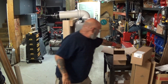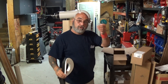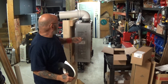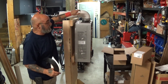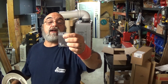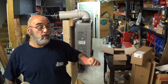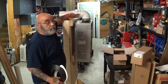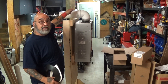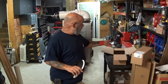You're going to get two thimbles and a bag of screws — three screws per bag. Put your three screws in here, which will lock the plastic to the plastic. Don't use anything but the screws provided. They're about a half-inch sheet metal screws. You do not want to go from the polymer into the plastic or the metal, because then you'll be introducing carbon monoxide into the air and this thing will be going off. You don't want that.